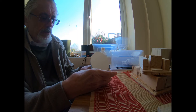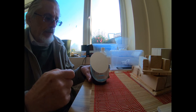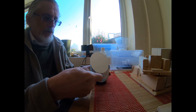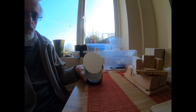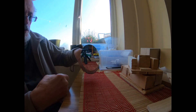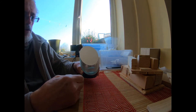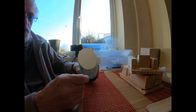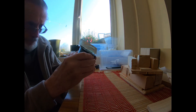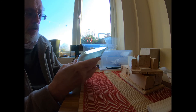Then you look through the focuser tube and make sure that this — which will now look like an ellipse in that orientation — should look exactly like a circle. And that circle must be concentric with the telescope tube and everything that you see. It's quite nerve-wracking; you must try hard not to ever touch the surface of the mirror, as it's a very delicate surface.